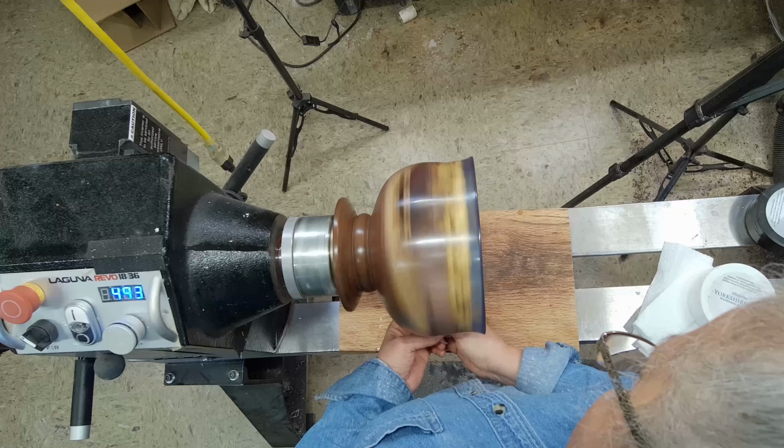All right, I'm gonna put a mark in here because I can feel myself falling constantly back into this groove. Right now I'm not too thin, but what I want to be careful of when you're in with your tools is that it's hard to tell, especially with these round little carbide tools, sometimes you tend to fall back into the same groove, or at least I do. So I am going to put a mark in here where I feel like I could potentially have that problem, or I feel the start of that problem.